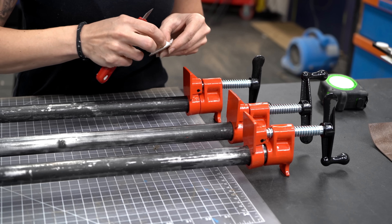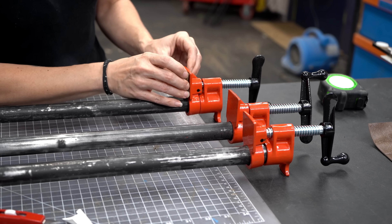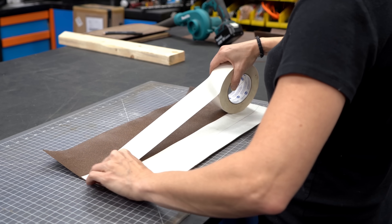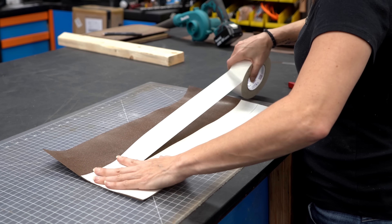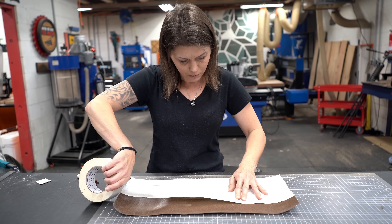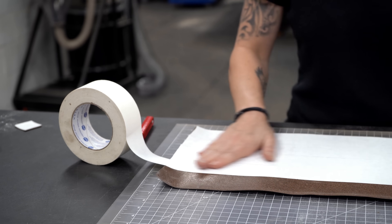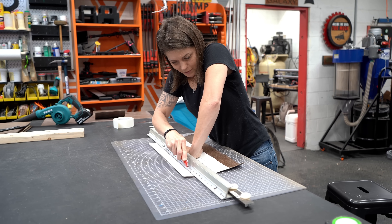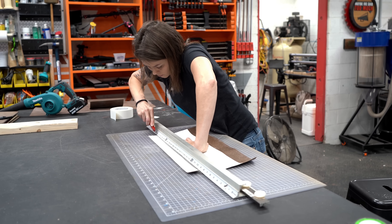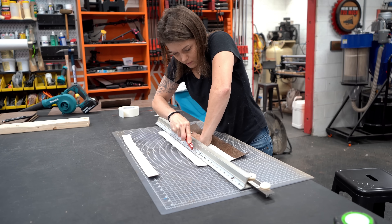If you decide to go with pipe clamps, it's a really good idea to put some kind of material on the jaws. The jaws are steel and can mar up your woodworking projects or your glue-ups. We love Andy Klein cork rubber — it's a really dense, non-slip material that we put on our clamps and vises in all kinds of areas in our shop. Putting the Andy Klein cork rubber right on the jaws does a couple of things: it means we don't have to put a caul in in some places. For most hardwoods we don't need one, and it protects the wood from the jaws while the non-slip feature keeps our glue-ups from sliding around as much.